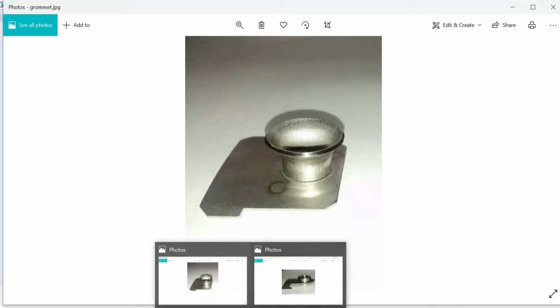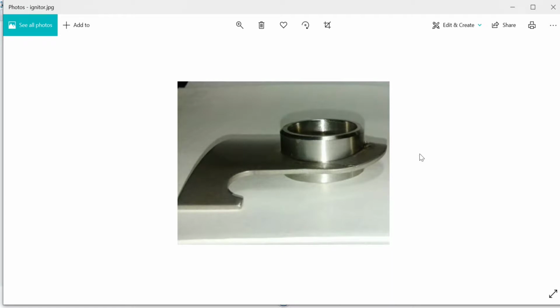Even for the grommet, the kind of curvature that you see here is where our interpolative system comes into place, making sure there's a dip of about 1.14 to about 3.14 mm. That you can definitely adjust. In the system we've done exactly that, so that the customer has all the benefit of the control system, where he can program what dip he wants at which particular degree.